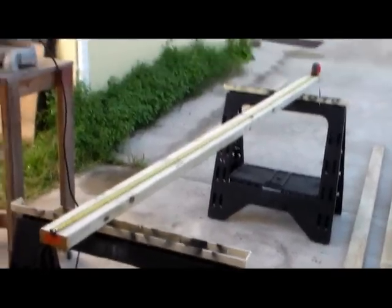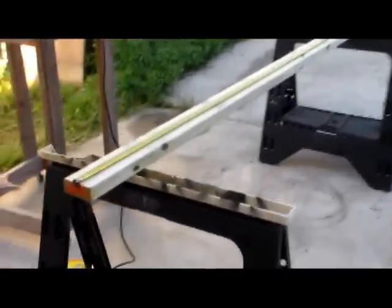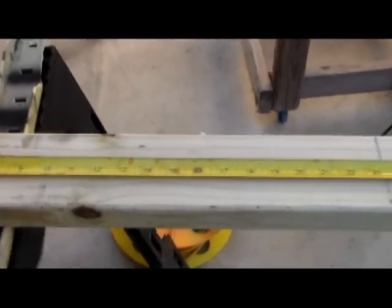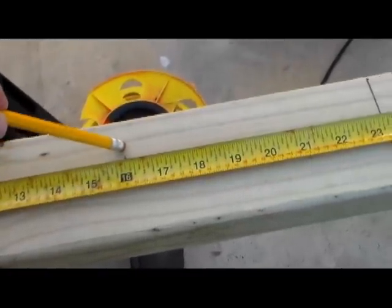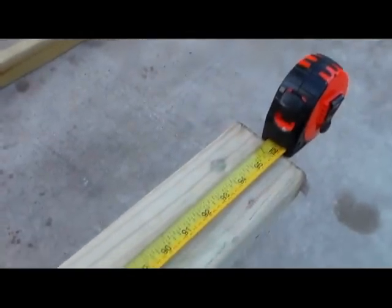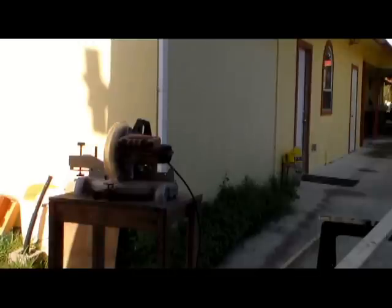It's pretty easy to do. The first thing we're going to do — in my case it's a 12-foot ladder — is measure the width of the steps. I'm going to make them 16 inches because that gets me exactly six steps on an eight-foot board. So lay down your tape measure, and there's the first hash mark at 16 inches, then 32, 48, 64, 80, and then the remainder to 96 inches. Take it to the radial arm saw and get it cut up right where we marked it.